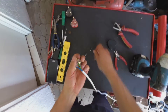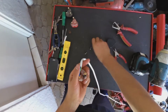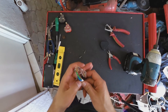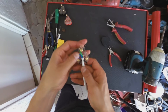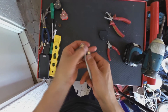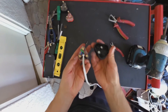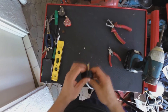Now you need these plastic pieces. It's important to let the plastic pieces bed into the white insulation. Now we just move the wires away from these screw mounts — we do not want them to get on the screw mount, because when I put the cover on it is going to press on there and it's going to damage the wire.